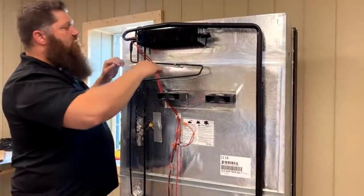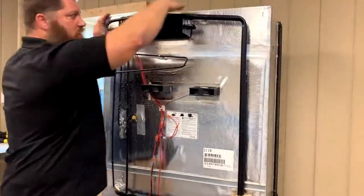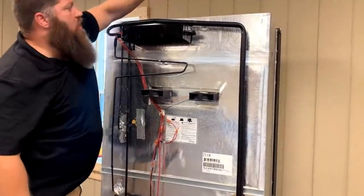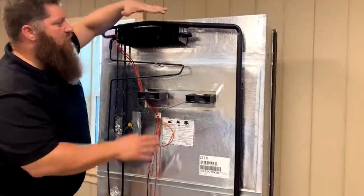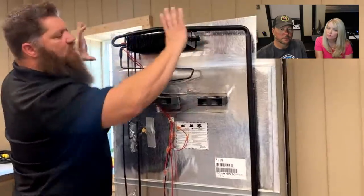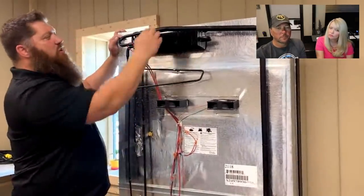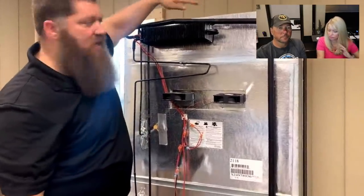You want to take this off, and you want to make sure that this refrigerator is enclosed no wider than the refrigerator itself. If there's an open spot right up here, all the hot air just simply sits right here. It doesn't escape. And if we don't let the hot air escape, then cold air can't come through here. When you take off your upper side vent, the top of this should be right at the bottom of your upper side vent. We want that cold air to come all the way through and then escape out. If we have a cabin, a space in here, that heat's going to stay there.